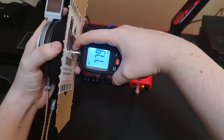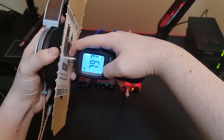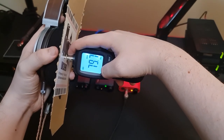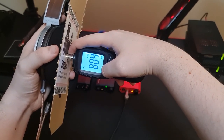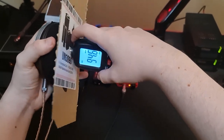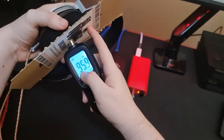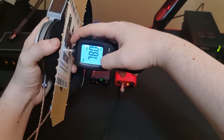Make sure that the probe is in the rough centre of the pads. You can get a continuous measurement, but I would recommend putting it on max mode — this will measure the peak volume level. Here, for example, we can see that my peak volume level is around 80 dB. Be careful that you don't accidentally knock it against the driver or make the cardboard squeak or clunk, because then you're going to get a massive false reading — like 96 dB here, which is not what I'm listening at. So let's just reset that.